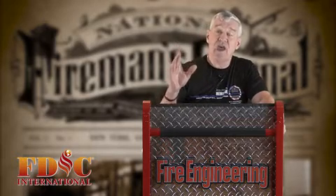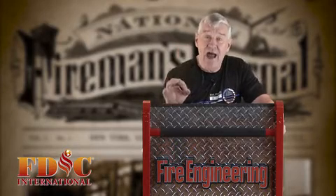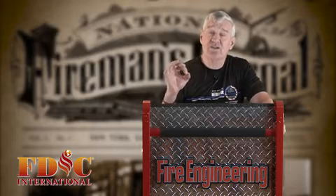Again, it's very important that the first step we take in an elevator rescue is to shut off the main disconnect, lock out, and tag out. But before you do this, make sure that the elevator is not dependent on strictly the brake to hold it in place. This is Bill Gustin with Miami-Dade Fire Rescue. Thank you.